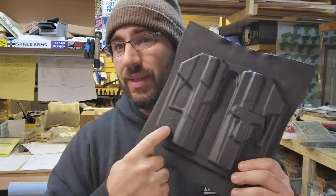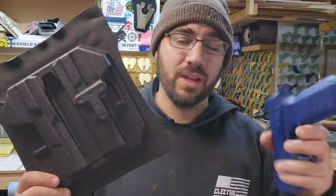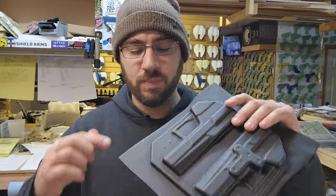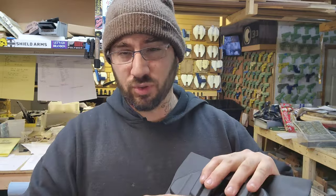Next we've got to make it holey. There are only going to be nine holes in here — no big deal. We're going to drill it and then go ahead and cut around the outside. Since I stopped investing in trim jigs after I got the machine, I'm going to make my own trim jigs out of half-inch MDF or birch wood with nutserts or epoxy — that saves me a lot of money per mold. We'll do this by hand. It's a lot easier when it's non-light bearing. No lights makes it so much easier because you can obviously see the outline. Drill it first, then cut it — I like to do it in that order because if you cut it first, it gets a lot flimier since that ridge gives it a lot of strength.